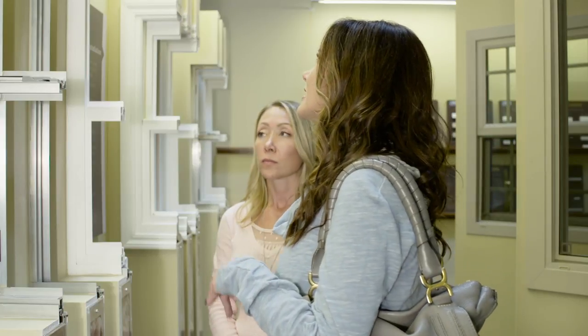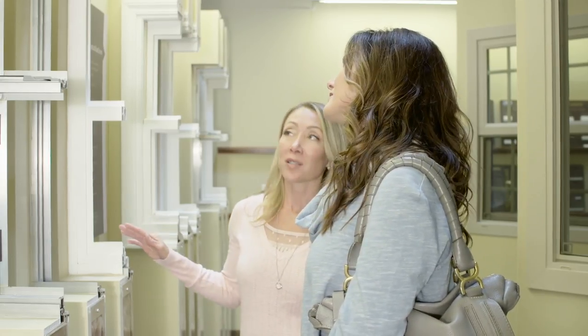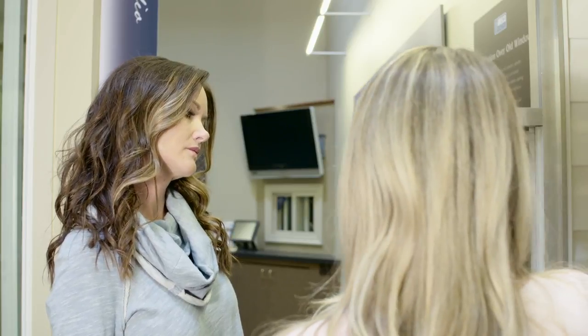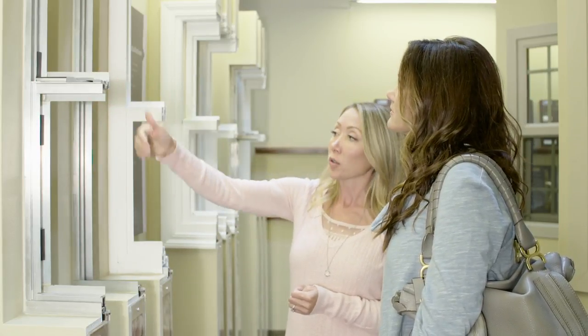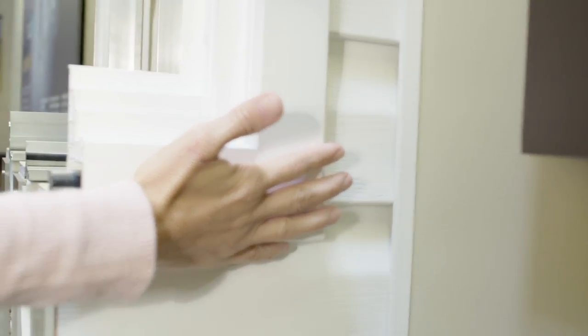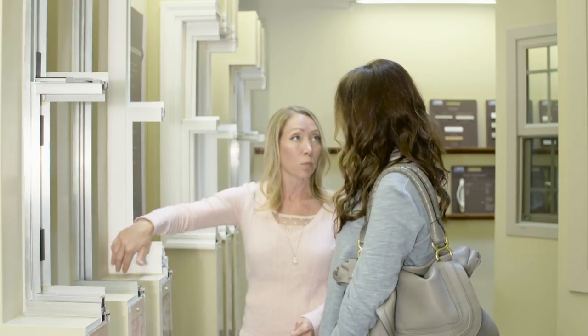How can I replace my existing cold aluminum windows without having to redo the stucco on the exterior of my house? What we'll do is a pocket window installation. We can use our studio series — it comes in a variety of colors and it's two and five-eighths inches thick. We'll come out to your home, take out all of the glass and the middle division bars in the entire part of the window. We leave the exterior part that is set into the original home, so it doesn't mess with the integrity of the water seal that's already there. Then this is what it will look like after we've taken out all of the extrusion pieces and the glass, and then we'll wrap it with a flush fin — a nice thick vinyl fin. We'll seal it up against the original frame, put insulation inside of the chamber, and if there's anything inside that's showing or unsightly, we'll cover it with a quick trim. That looks really nice.